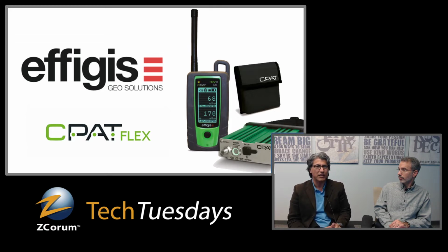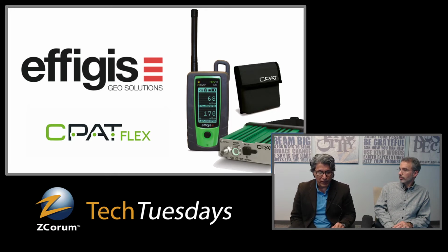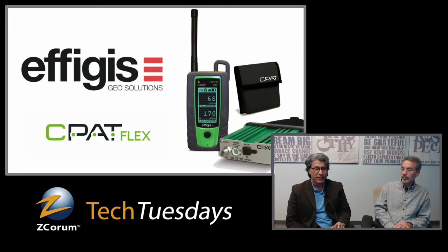You're going to see shortly a little video on the steps, but at a high level, you have an injector and detector pair. You would disconnect the drop at the tap, and at the tap, you would put the pressurizer that works in the mid-band as well as the LTE band, and essentially you are transmitting towards the house. So of course this is a service impacting activity.